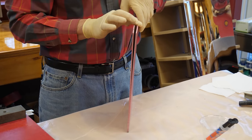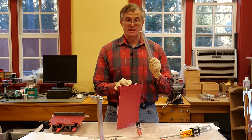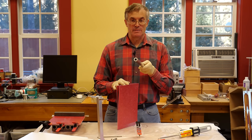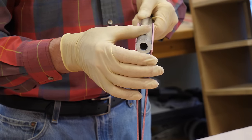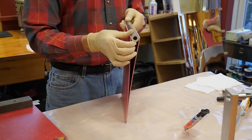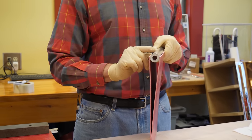The spacer could be anything, but what's nice about using a round spacer is that there's only one contact point — a square can tip and tilt depending on where on the surface it's mounting. By placing this little spacer in here, if you wanted a nice rounded front to your rudder, you could leave this only halfway into the gap and get that nice rounding already. The problem is feathering this edge between the two different types of material is kind of a hassle.